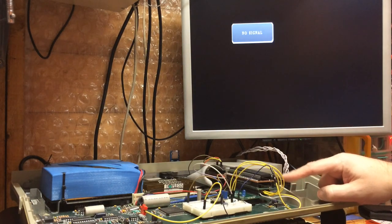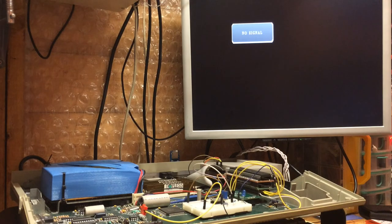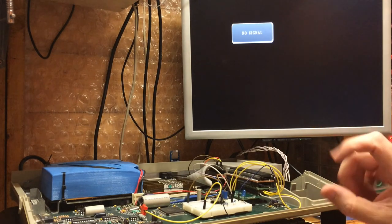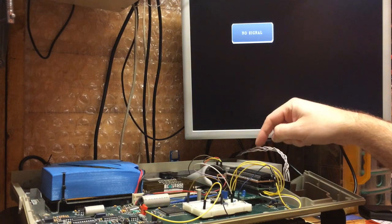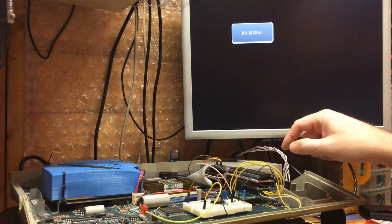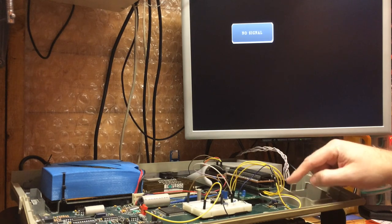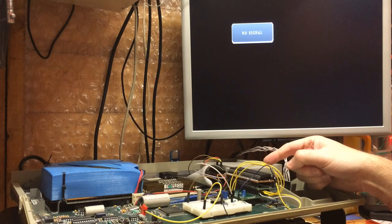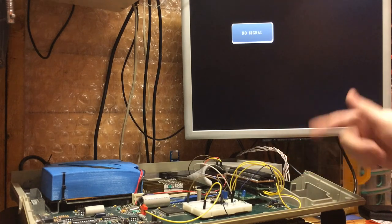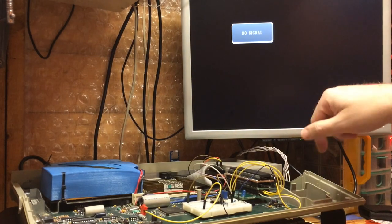There's a 32 megahertz oscillator on board, which is fine for what we're doing here, but I wanted to test the SD RAM at the most optimal speed, which is approximately 66 megahertz for the clock of the SD RAM. You should get the best performance. That's then divided down four times to get 16 megahertz for the CPU, and the SD RAM runs at the full 64. And obviously the main system bus is 8 megahertz, which has been fed in as well.